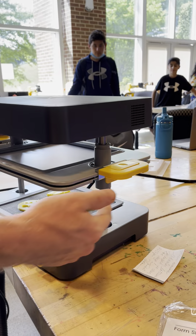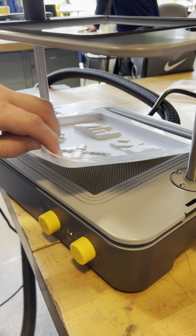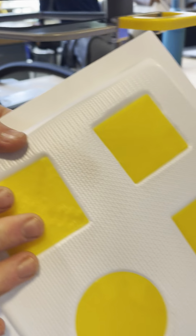Once it stops, you're going to unfasten these two handles — they lift up — and place that back into the holder at the top. You are going to remove this plastic part, and then whilst the material is still warm, press out your molds like so. And there you have your finished vacuum form sheet.